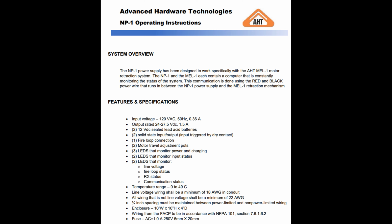So, I dog this panic down, and I'm going to hit the keypad. That motor is fully retracting. Now, I'm going to undog the panic. Hit it. It doesn't fully retract it. And that's when the door is in the locked position where I'm not dogging the panic. But if I don't put a load on that panic, it fully retracts.